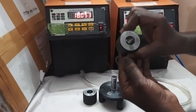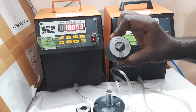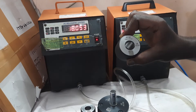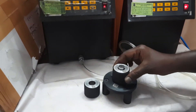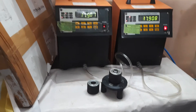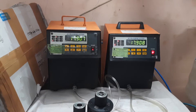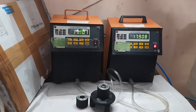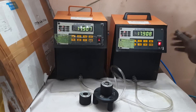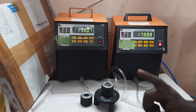We are going to put the plus master. The size is 17.887 plus 0.021 — this is the master value. So the ring value is 17.907. This is the value of the ring. Now we are observing, and the overall taper of the ring: the master ring is having 1 micron taper.